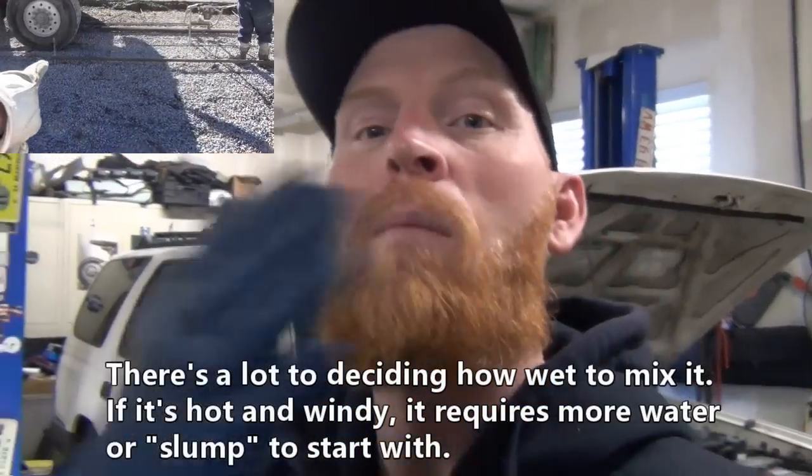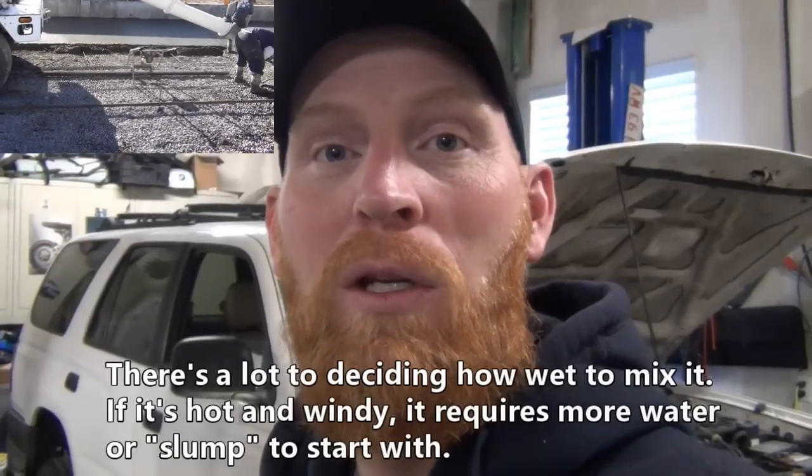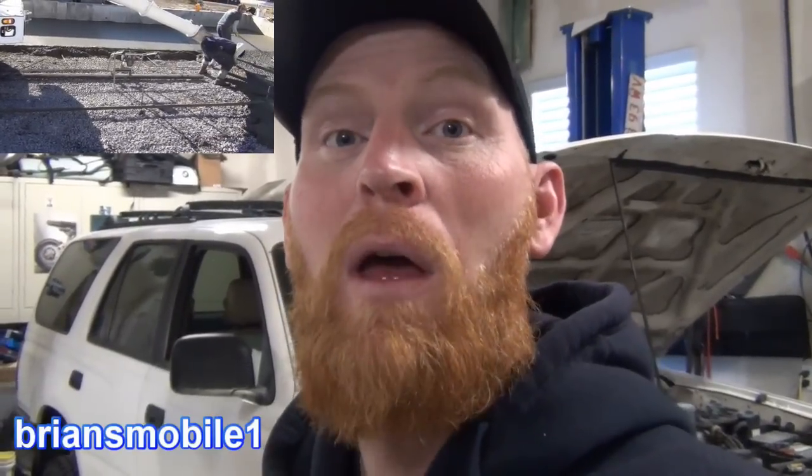But if it's too cold, or if you don't have sunshine, or even wind moving across the concrete can cause it to dry at different rates. Another thing you can do is start the chemical reaction off with hot water. From the plant, when you buy the concrete, you pay a little extra, get hot water and calcium, and then you can do concrete in the winter. But then there are certain precautions you have to take to make sure that on the second or third day it doesn't freeze.